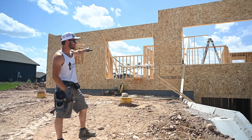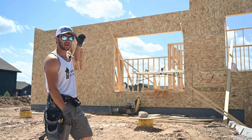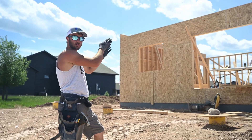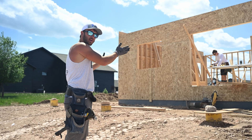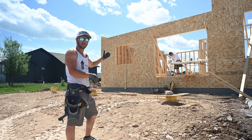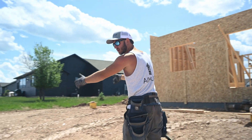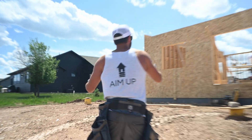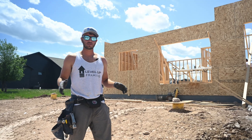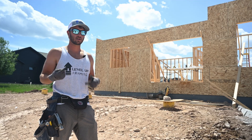Here in the back of the house you can see that wall all the way through the building — that's the wall we're going to start setting trusses on and work back this way. I already drove the telehandler in here between these two footings just to confirm we could reach that truss to get it set. The strategy is to back out, grab a truss, and come back in quickly. I want to stack my pile right over here so I can drive in, hook up to a truss, back up, go right into place, and work our way out towards the gable.